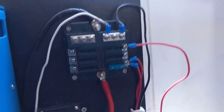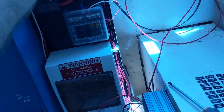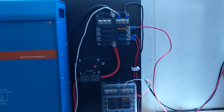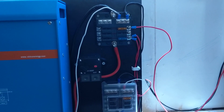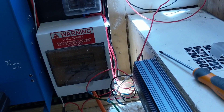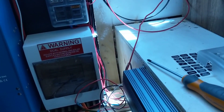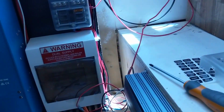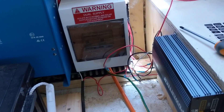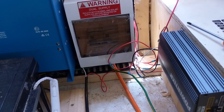I've already put a water pump sticker on the fuse block — our fuse blocks came with a bunch of stickers. Now I've just got to put a fuse in it. It recommends a 5-amp fuse on the actual unit. It might be different if you've got the 12-volt version; our 24-volt is 5-amp. As far as wire size goes, I've used 15-amp automotive wire — I think that's about 14 AWG in the American standard, might be 16. Everything we buy is rated in amps, so it's definitely more than we need, but we used 15-amp wire throughout so we knew we wouldn't have any issues.